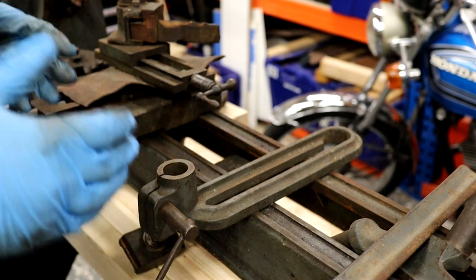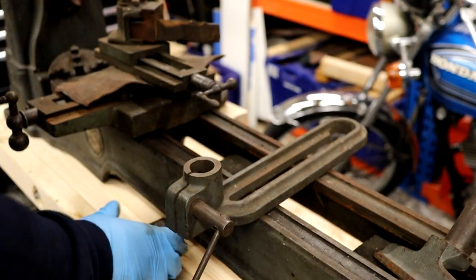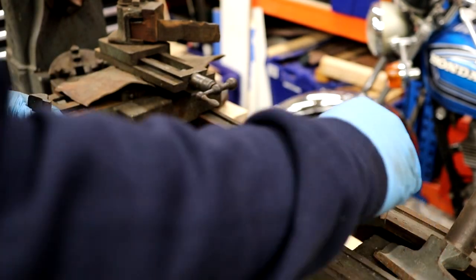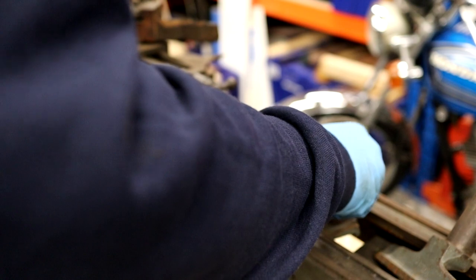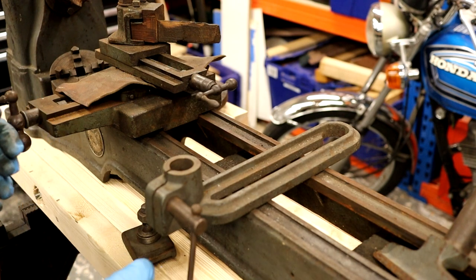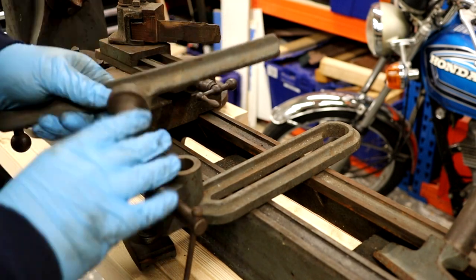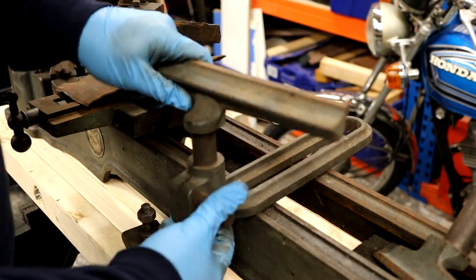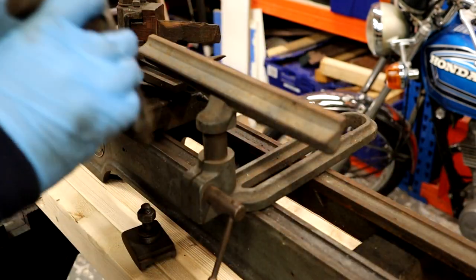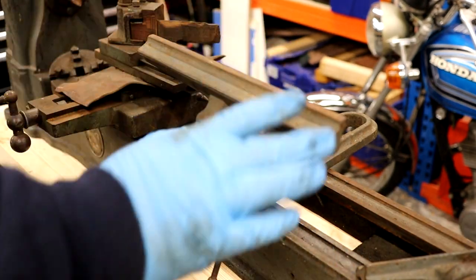This is the tool rest — the banjo — and your actual tool rest on top. Very similar to the headstock, you need a three-quarter inch UNC spanner to move and adjust this. The modern ones have cam lock handles at the front. You've got a one-inch stem for your tool rest, and we've got what I'm guessing is a 12-inch rest and a four-inch one, so quite a nice selection.